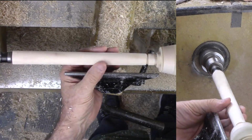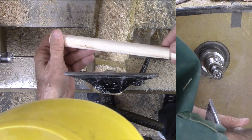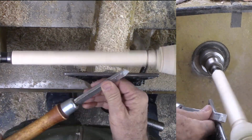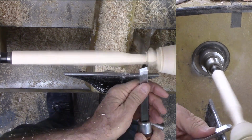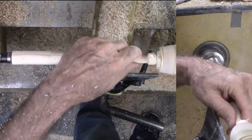There is a controversy whether the skew point is up or down. My answer is whatever you're used to. My point is down. With it round, I can make the first axis shift. My faceplate has holes for 1/8 and 1/4 inch labeled 1, 2, 3, and ABC. This project will only use the 1/8 offset and holes 1, 2, and 3.